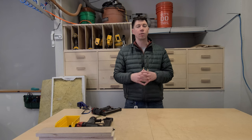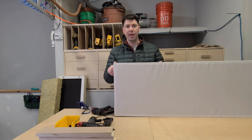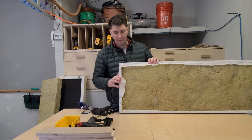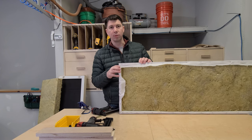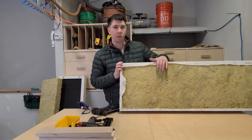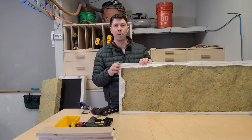There are really two different types of acoustical panel designs that I'm aware of. You'll see a lot of this first design on YouTube already. This acoustical panel design is made using 1x3s with some fabric over the top. One of the disadvantages of using and securing 1x3s together is you can have some racking, and it's a little bit heavier. The joint here is a butt joint — two pieces together — held together by some screws with the acoustical insulation in the middle. This is a Rockwool Safe and Sound, rated for acoustical panel use, and it's just wrapped with some fabric and has the 1x3s butted together.